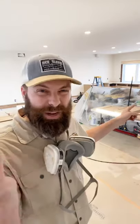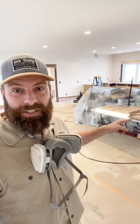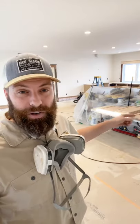So this is my job site setup. We've got our little ad hoc five-gallon thing here. I've got my staging table behind me. I've got an LED light shining across it to see any flaws. We've got plenty of light, but why not? All my cabinet doors are stacked from biggest to smallest. I always start with my biggest ones because it covers up the pedestal enough. And when you get down to the smallest ones, you're kind of spraying onto the pedestal, and I don't want to set a cabinet door up there.